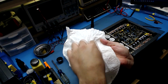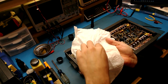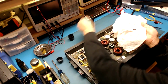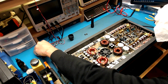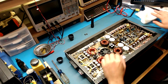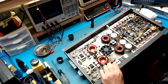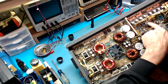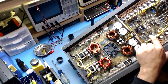They look like they're from the preamp section. So this has been into before, and the amplifier section has been touched. So I'm assuming that the amp board has problems as well as the power supply. We don't know yet. So that's our first clue. Let's see where those parts were removed. Okay, they were removed from one of the channel pre-drives. Like here, there are 2 pairs on this channel. Let's see if I can get this closer up.